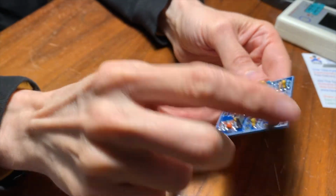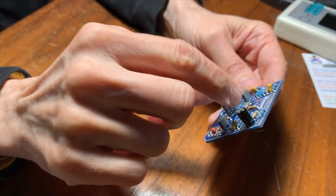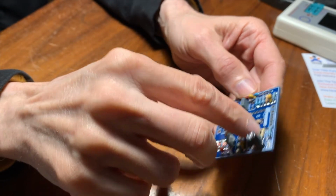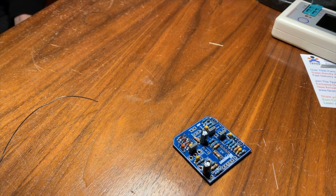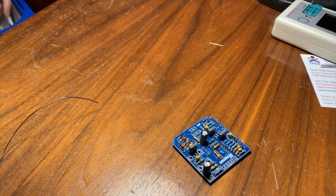Yeah, what else do we have to do? There's a couple capacitors that need to go in there. Oh, well, there's this other diode, D6, and this is one that they use to protect against reverse polarity. So it's like reverse polarity protection. If you were to plug the power supply in backwards, you'd be sacrificing this diode over ruining your circuit, or some other parts in the circuit.